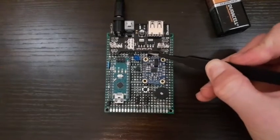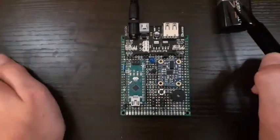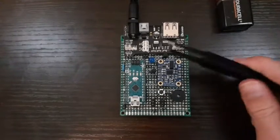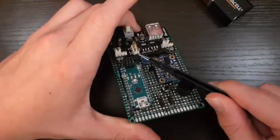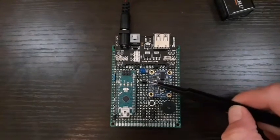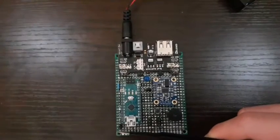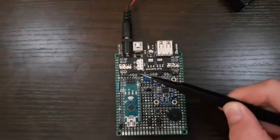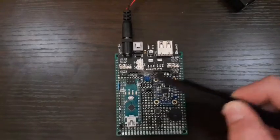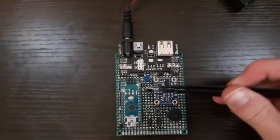Over here we have two transistors. They act as supplying high amounts of voltage to components — such as my ejection charge that needs five volts. I have these little pins over here which I connect the ejection charge to, and that's in charge of separating the stages to deploy the parachutes. Then this transistor right here goes down to these pins, which ignites the motor. I plug in a five-volt pin and ground, and these just regulate the five volts because you can't put a digital command straight in there — it's not a high enough voltage.